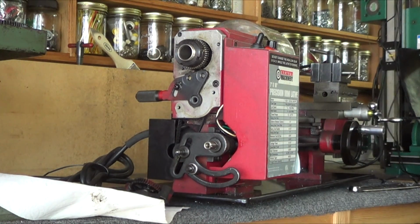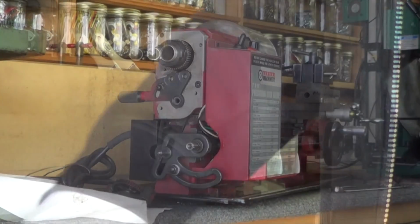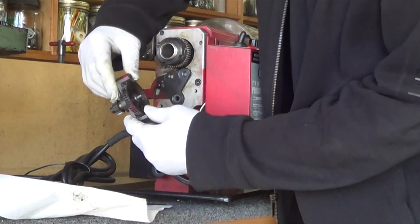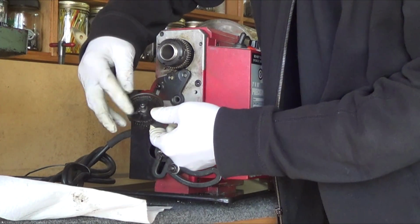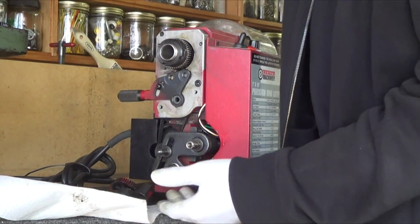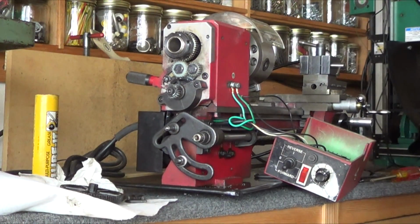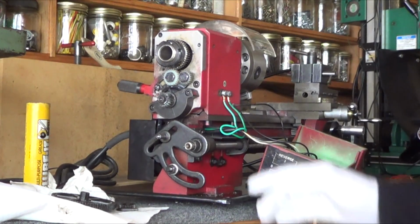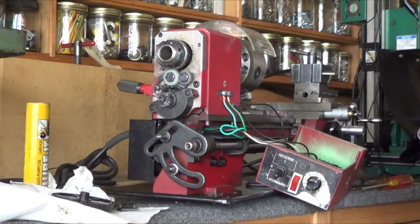Alright, well, I've got a little bit more cleanup to do, and then I'll put it back together and see if the sound's gone. I forgot to mention there was no grease in here. Seems like the shaft is okay. Doesn't look like any wear or anything on it or slop, but there was not one bit of grease in here. It's pretty dry. I'm surprised it survived. Alright, well, messing around with this, I guess this guy's got a little chip in it, so I'll be putting that on order. I also wrecked the 80 tooth gear, which I'll get into.